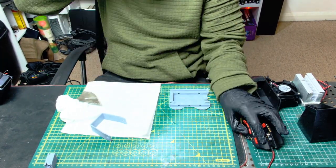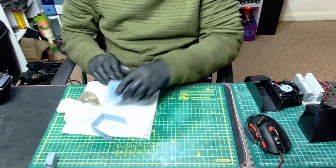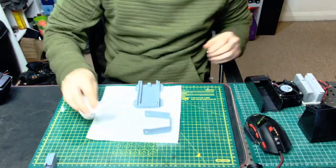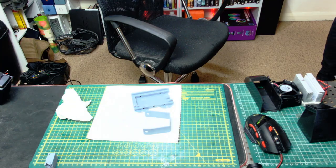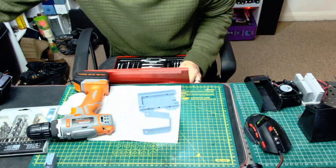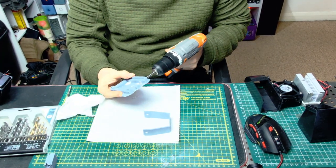The build plates that I've developed here should be able to be easily machined on a CNC mill, but also equally be able to be injection-molded in composites. So, depending on weight tolerances and things like that, I could either go with aircraft-grade aluminium and get it machined, or I can use just a composite and get it injection-molded, which will be, obviously, proportionally cheaper.